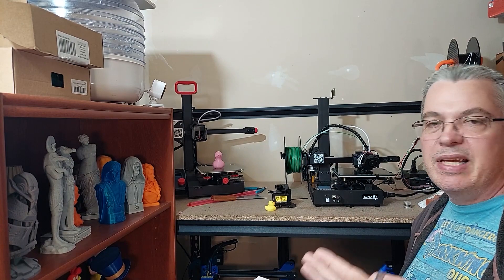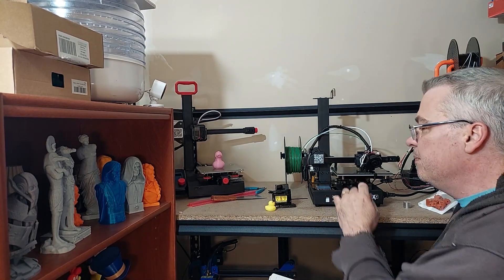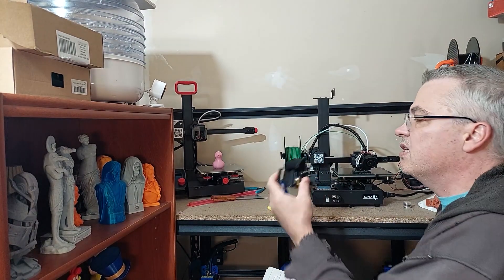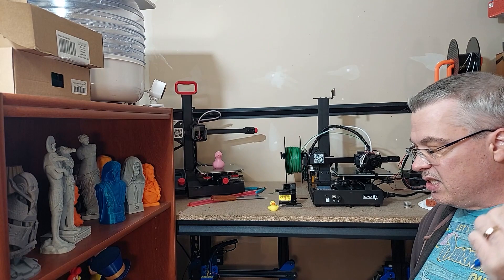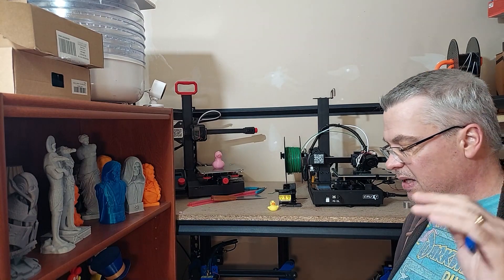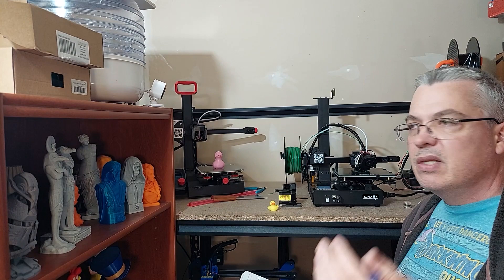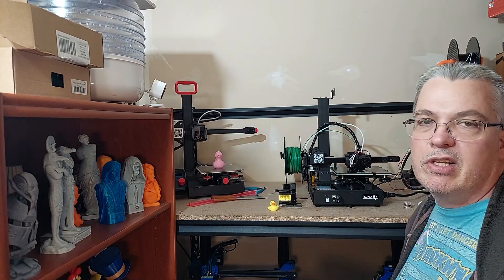This BQ extruder has the bimetal heatbreak, so I can do a whole bunch of different filament types. It will go up to 110 on the heat bed and 275 on the nozzle. With the bimetal heatbreak, that allows me to print a few different materials than the original Tronxy, which had a Teflon tube inside the throat. For Pronterface offsets, you have M206 for the X — I went X7 and then save that. For E steps, they recommend 932; I went higher, around 1100. Double check when doing your extrusion — do your 100 mils, check it, double check it, and save everything with M500.